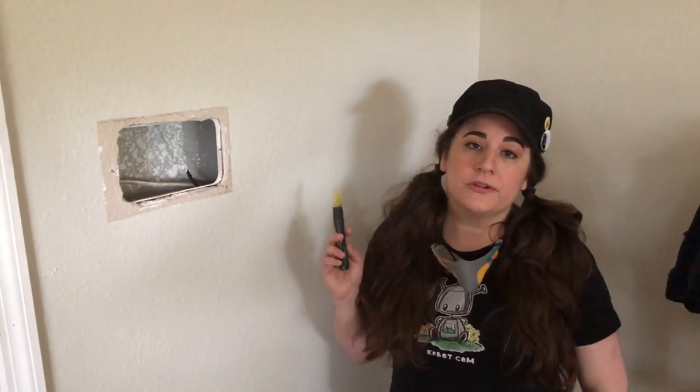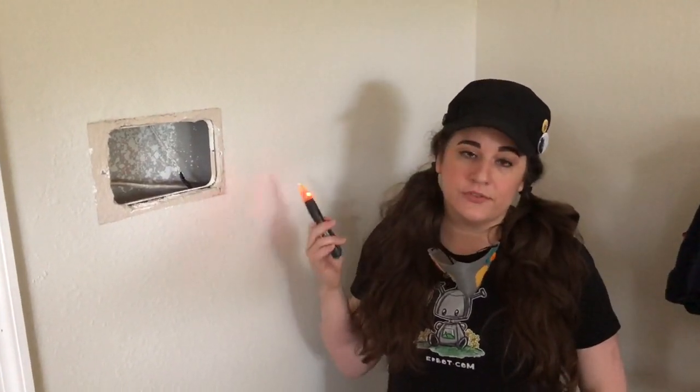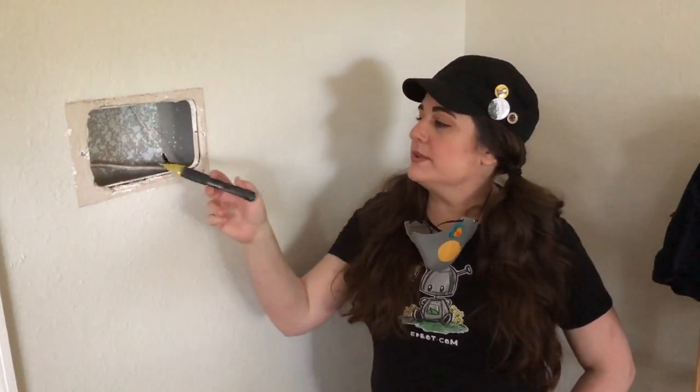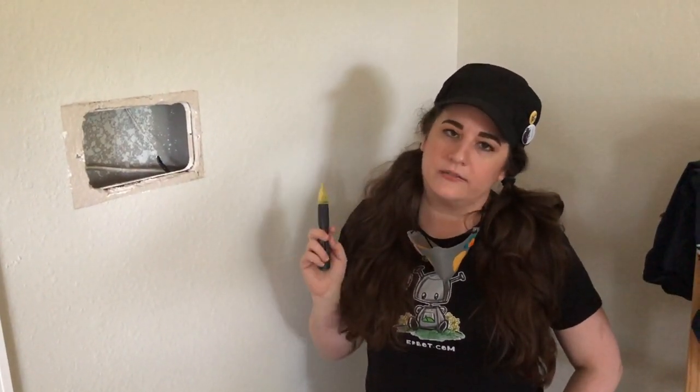The speaker intercoms were not wired, but just in case we want to double check any other wires in here to see if there's power running in them. I've got my tester here and there is power in here, and that's good to know. So we're going to be leaving this alone while we work. If you see any wires, get a tester and check it out.